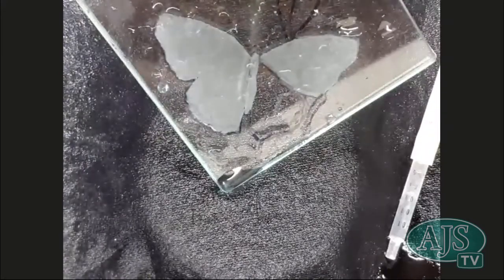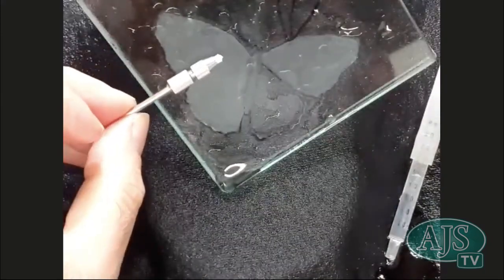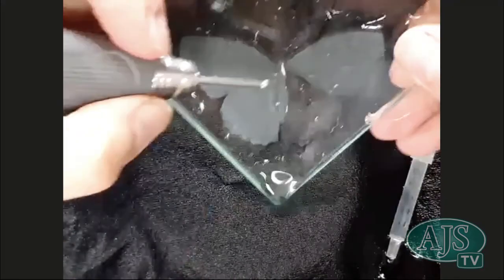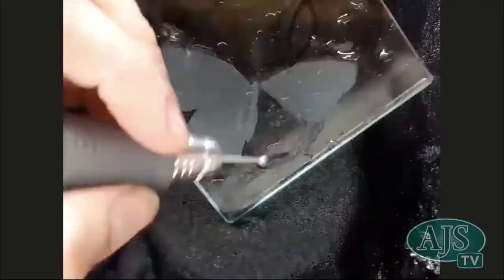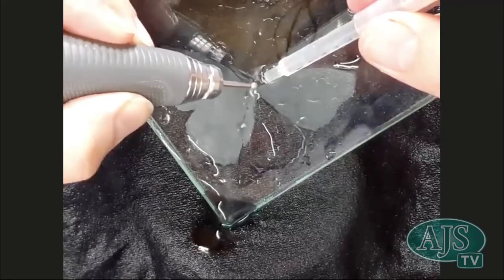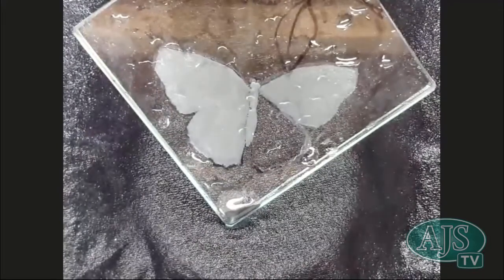Changing tools is nice and quick. So I'm going to cheat because I'm going to use 3mm polishing pins, which are these little guys. They're a rubberized pin, but it's mounted in a little mandrel there. The pins actually look like that. They're 3mm ones. And because I'm going to be polishing out these eyes, I'm going to lock it in. And all right, there's the eye. So we'll polish them out in a bit.